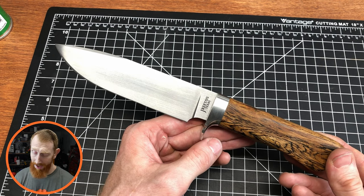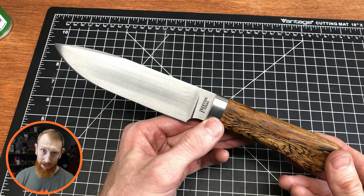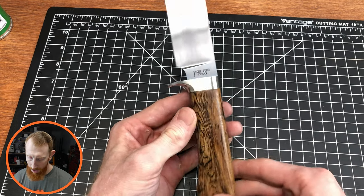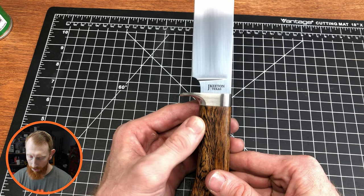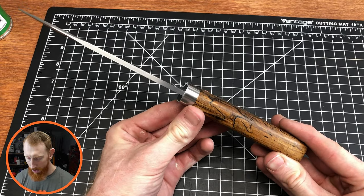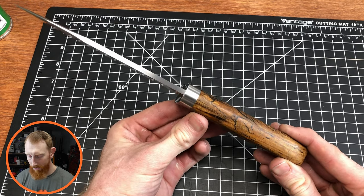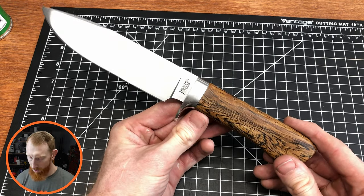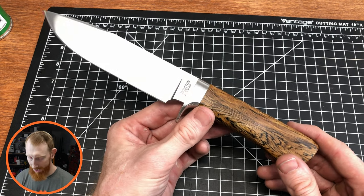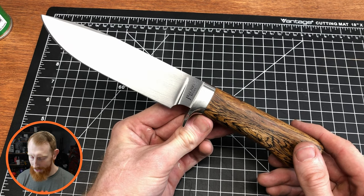Now for some things I don't like. First and foremost, the guard is slightly tilted backwards — I actually tried not to do this but messed up somewhere in the process. Next time I need to make sure my guard has a slight forward cant instead of a backward cant, because it really throws off the lines of the knife and makes my maker's mark look crooked. My handle overall is a little bulky — I didn't taper the front around the guard as much as I should have. I should have tapered it significantly thinner near the guard and widened it towards the back; right now it's just pretty straight, which makes it look chunky.